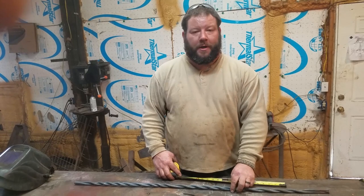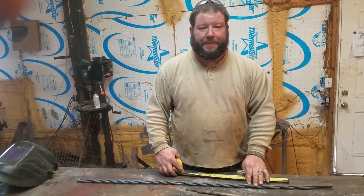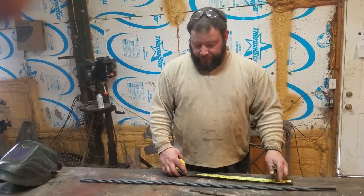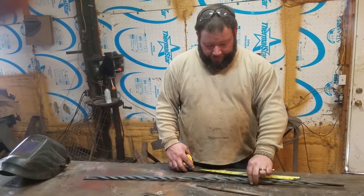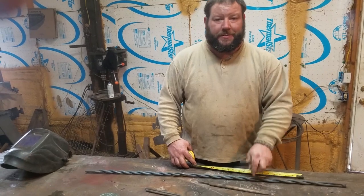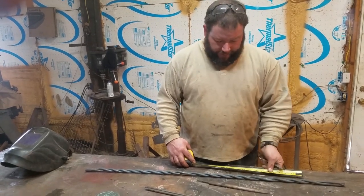We've got our pieces of barbed wire twisted up. This is two pieces of 3/8 bar. We tack welded them together on the ends and we twisted them. These are a little longer — these are actually the pieces on our project that are going to get the barbed. That other piece was just some little short pieces we needed for strength.